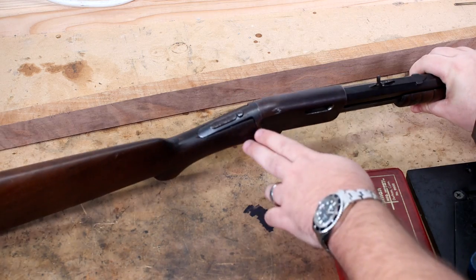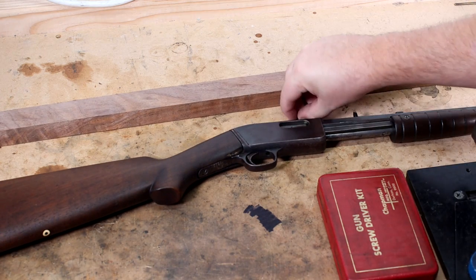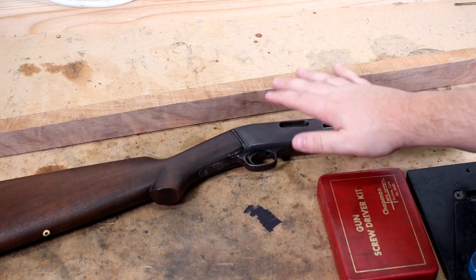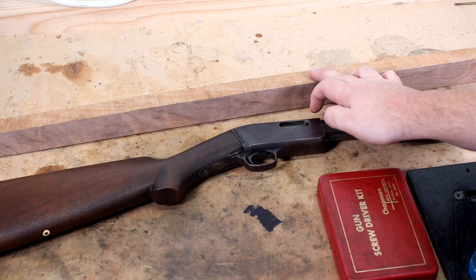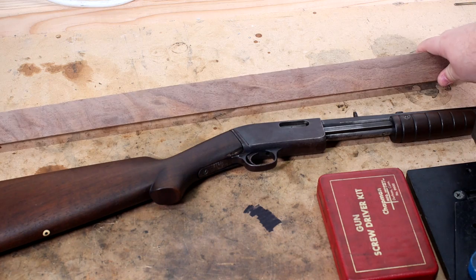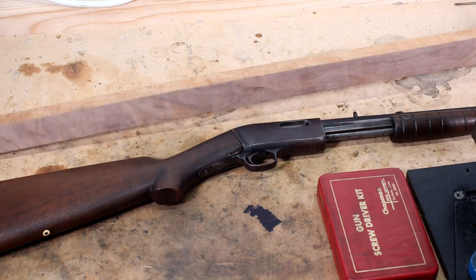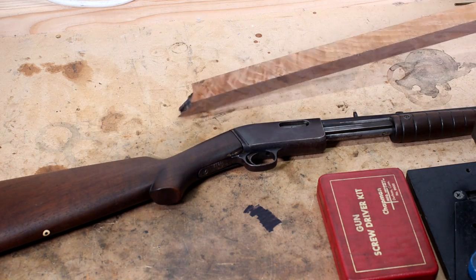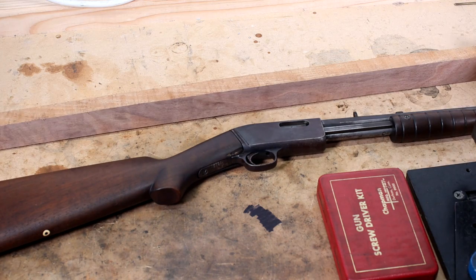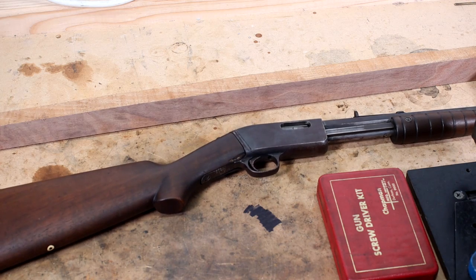For these broken sections up here — we have a broken chunk there and a broken chunk down here — I went and got a piece of black walnut. If you're looking for hardwood to redo gun stocks, I checked with a local old-school cabinet maker that's been around Gainesville for years and years. They actually had a stockpile of good hardwoods in the back. This broken piece — it's got a big knot in the front — was sitting there and I think I paid eight bucks for it. That will repair maybe 30 stocks because all I need is a little sliver on both sides.